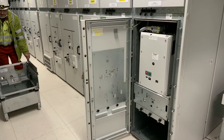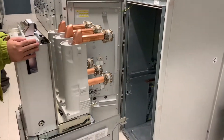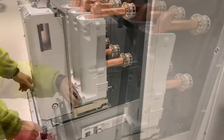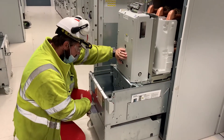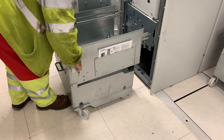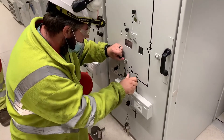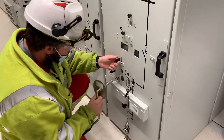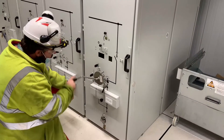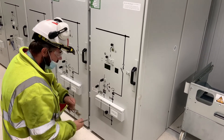Once we're happy with that we lock it all up and proceed to the substation to remove the isolation on the MV switchgear. This is 11 kV switchgear but we're operating the system at 3.3 kV. First we put the truck into the test position, lock it into position and remove the carriage. Then connect the umbilical cable at the top and close the door. Next we rack the breaker into the service position, which moves the vacuum circuit breaker back into the housing and engages on the busbar and circuit connections. Finally we move it to the fully on position and the breaker is now ready for service.